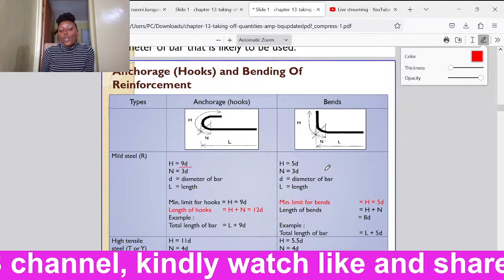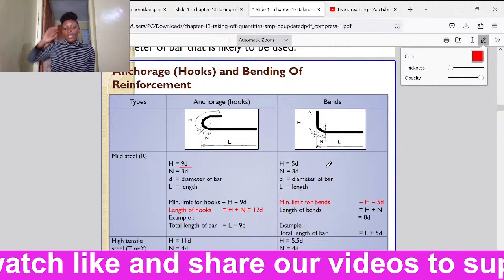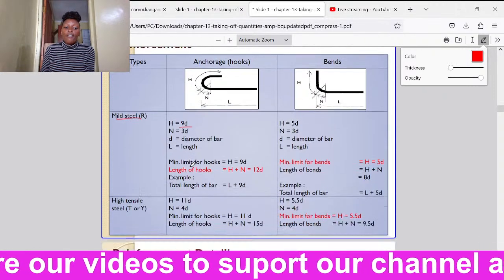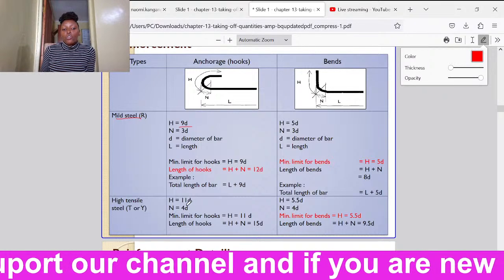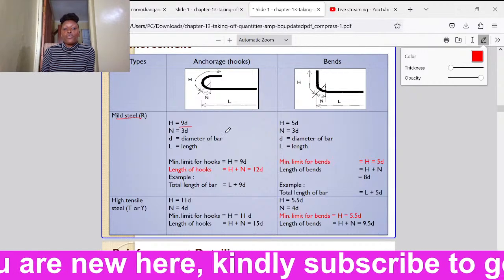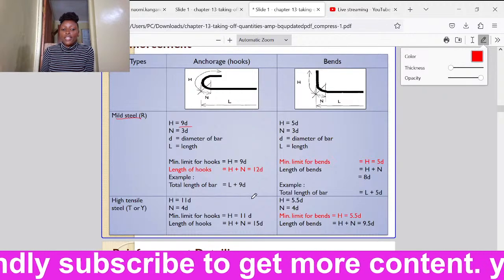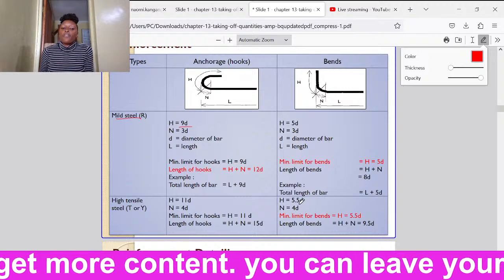These are basic formulas that we shall use to know the length of the reinforcement bars. This one is for mild steel. Then we usually have another one for the tensile steel, high tensile steel. It usually has different formulas for these. So once you want to know the length, if you're using all these, you need to know these formulas of calculating the length. So what we'll be changing is only the diameter of the bars.